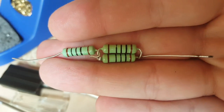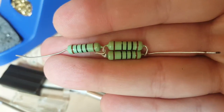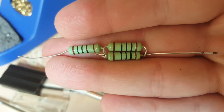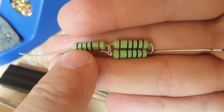To get 150 and 50 ohms, I have two 100 ohm resistors in parallel and one 100 ohm resistor in series. What I have to do to switch between 150 and 50 ohms is to short the 100 ohm resistor right here.